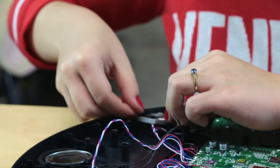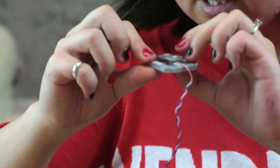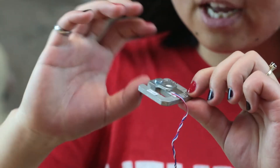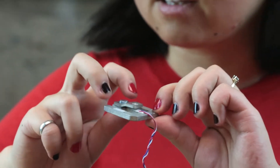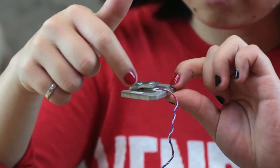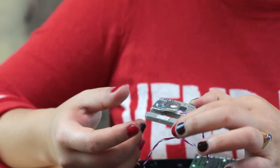It sits in here like this. So you're pressing this down while these things are not moving, and that translates into mechanical strain. When there is mechanical strain, the resistance of this whole piece changes. You're using this thing as a resistor — a very, very primitive resistor. And then they look at all four and do some math, and that's how they know what your weight is.